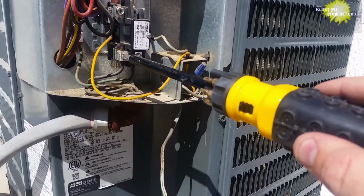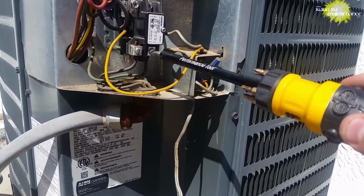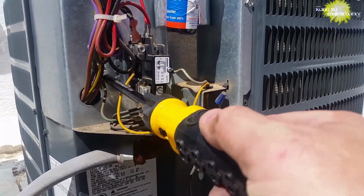The preventative maintenance continues. Been going through looking for any deficiencies. Here's one I found today. It's a good idea to tighten the incoming voltage wires to the contactor and the ground screw to the cabinet as part of your preventative maintenance.